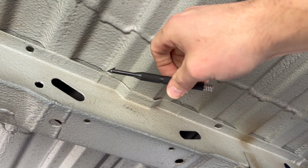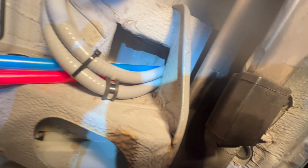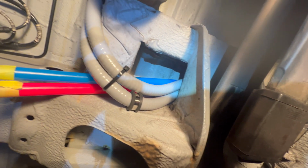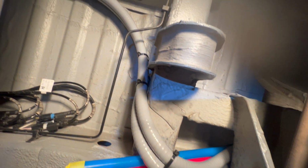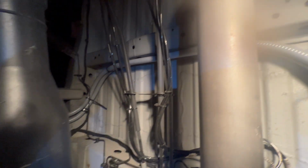conduit underneath the van. All those riv nuts hold things tight along our final conduit highway which goes out the boot, over the top of the leaf spring support and looping around the frame. Afterwards I head towards the rear of the van, leaving plenty of space around the brake lines and tuck it along the first cross frame member I encounter, to which I repeat the exact same thing on the other side.